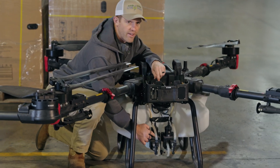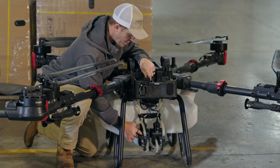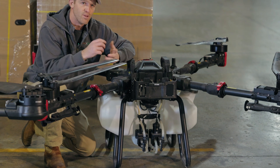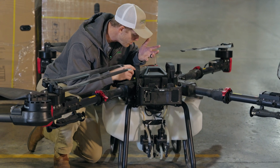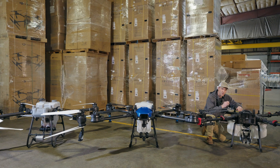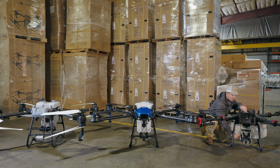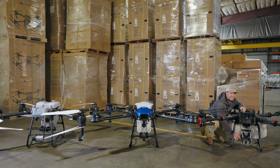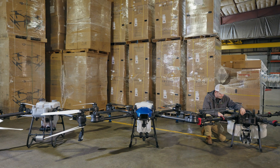These XAG pumps are very difficult to service in the field — you need a lot of hardware to get them apart, and inside you have roller bearings that require grease. You have to grease the inside of those peristaltic pump housings because you're squeezing the hose; otherwise the hose will burst. Depending on how often you're spraying, you need to reapply grease at least once a week. It's a big problem with the XAG pumps.